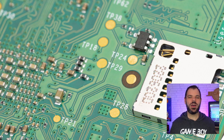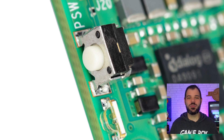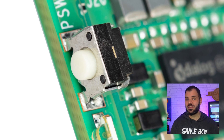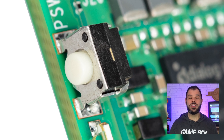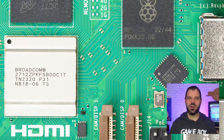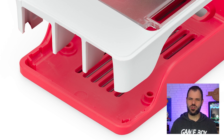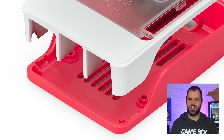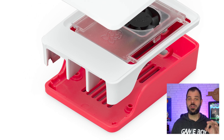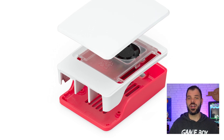Among the new features, for the first time in the history of Raspberry Pi, there is a push button to turn on or off your Pi 5, and on the horizon for 2024, very probably the possibility to put it in sleep mode. There is also the arrival of an RTC clock powered by an optional external battery. Additionally, an official ventilated case for the Pi 5 is necessary due to heating issues — Raspberry alerts us that the Pi 5 must be well ventilated and not placed in a closed case without ventilation.